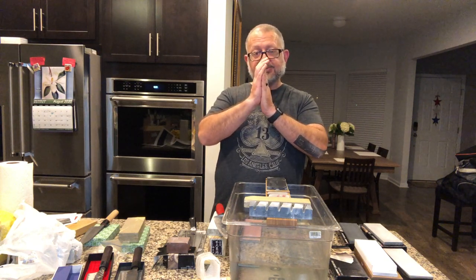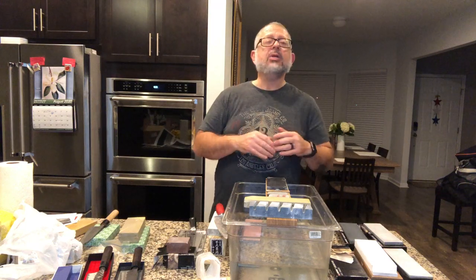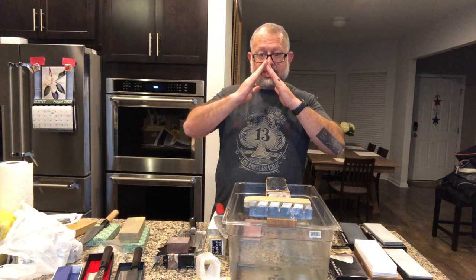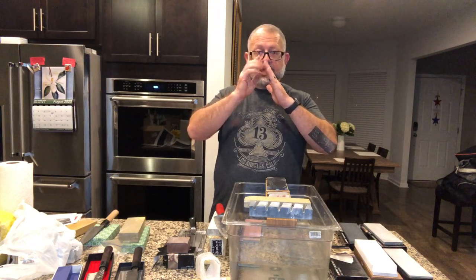When we do, some metal is going to flip over, and then we turn the knife over and sharpen, and it flips over again. For those of you who are new, who just signed up on the forum and got a stone, we call the piece of metal that we're trying to make a burr. We're shaving metal off one side, then the other, and we'll be left with a brand new triangle. But in the end, there's going to be a piece of metal wire.